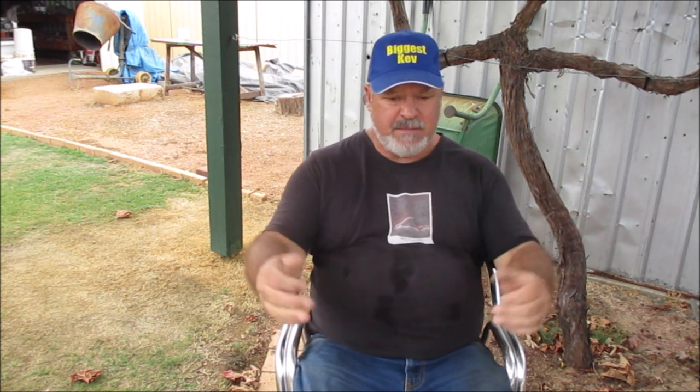Anyway guys, I hope you got something out of that. I'm still learning all the time. I've done a few smelts, but I'm always experimenting and trying different methods. I don't like to use lead as a collector metal. I've seen it on videos, but then you've got to do another thing with it, with the little cupels. You've got to cupel the lead out to get the gold back. I'm not into that sort of stuff. I'd rather get the gold.